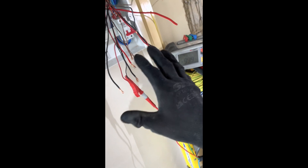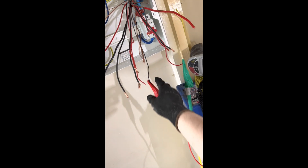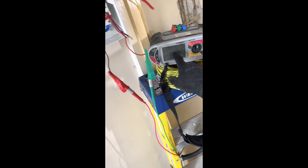I forgot to show you a pre-board check. There are two lighting circuits — you go to the neutral of one circuit conductor and the line of another one, flick switches — it should stay like this. If it registers a dead short, you know you have some kind of borrowed or shared neutral. I've got another video or highlight where I explain about it more, but that's another test to do pre-board change.